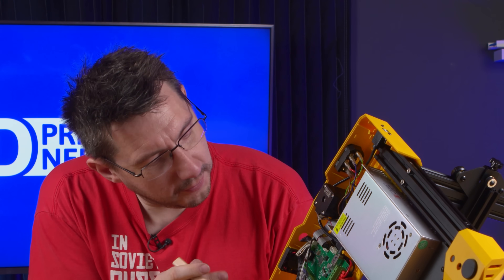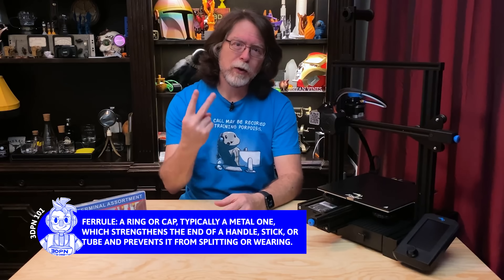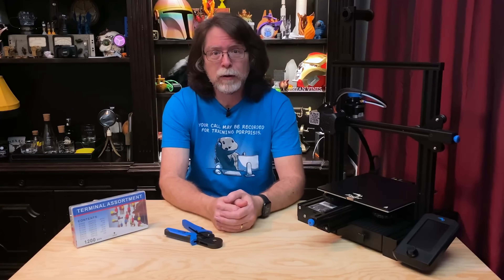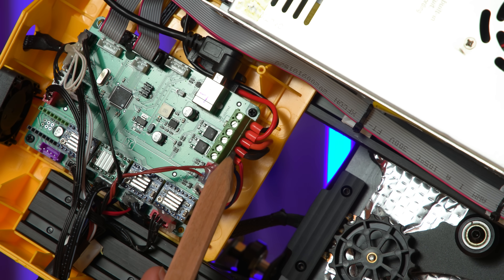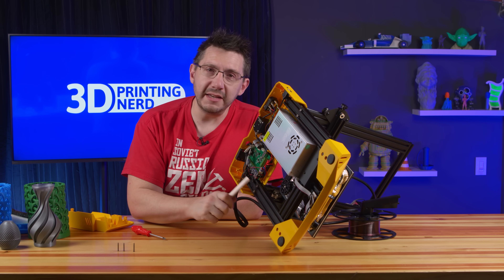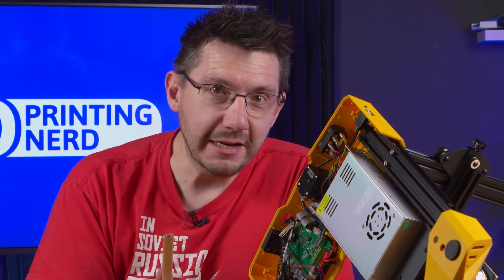We've got a great look at the board right here. What's really interesting — all of the stepper drivers are removable and replaceable, which came in extremely handy during the stream. One thing to check for is how power is connected, and the best way is a crimped ferrule. My friend Brian Vines did a video about ferrules — I'll put it in the description. You can tell the wires actually have a ferrule crimped into place before being inserted into the block. Sometimes you'll see printers with tinned wires; that's better than bare wire, but not by much. Always consider crimping a ferrule onto your wires — you want to be safe with power.